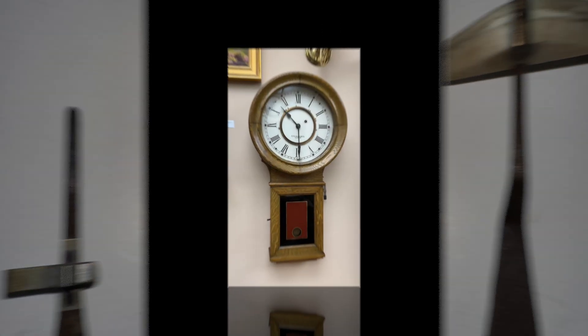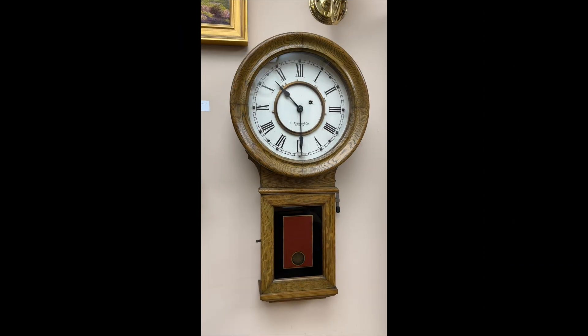This clock is in pristine original condition, but does it work? The answer is yes, it runs beautifully, but the bell ringing is faulty. I hooked the bell to the contacts on the top of the clock and was pleasantly surprised when I heard the sound. However, it's supposed to ring only when programmed, but not here — it actually rings when it reaches each of the 12 five-minute contacts.